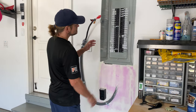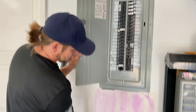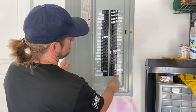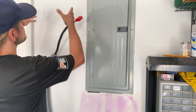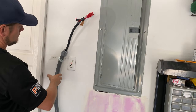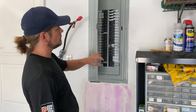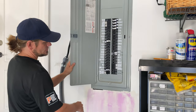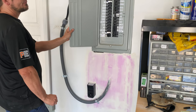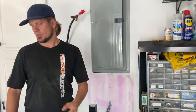Let me show you how this worked out. We have a GFI-protected outlet because we're going to plug this in — this is a surface-mount plug that we fished in. Then we have an 80-amp protected circuit coming out for an EV charger. The charger capsule is coming out in about two months, so we just capped this off for now. We have to surface mount it because the wire is as thick as number four TC cable — otherwise you're typically using eight or six gauge wire depending on the ampacity.